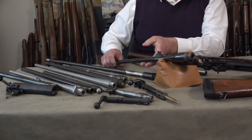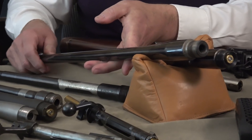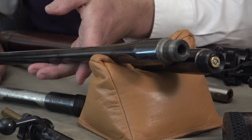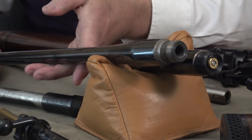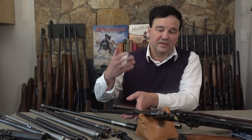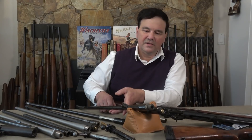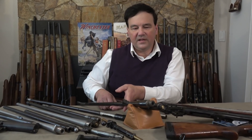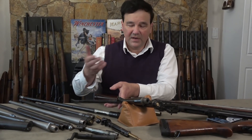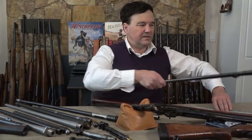For fun, I pulled out this one — this is the Browning bolt rifle, so quite a lot of threading, a long barrel shank, and again no extractor cut. Starting with the maker of the Remington 700, manufacturers decided to go with no way for gas to get out except through the so-called gas management system. The Mauser is also gas tight on firing, but if something goes wrong you have to have pathways for gas to escape.